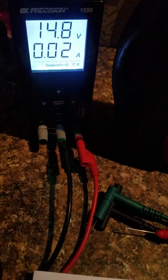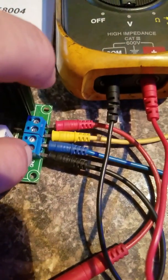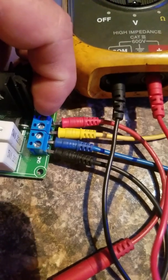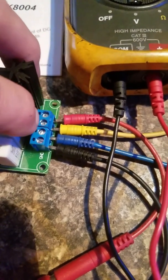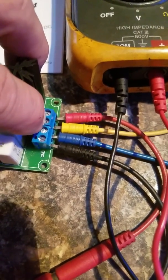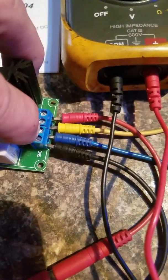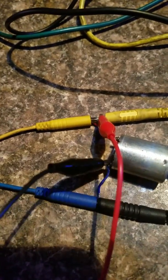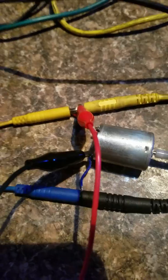You can see my source voltage here — I've got 14.8 volts going into it. That comes out of these leads and I've got it coming in here. The outside ground there is input, the outside over here is positive input, this is your positive output, and that's your negative output. I've got my outputs running over here to this little DC motor.